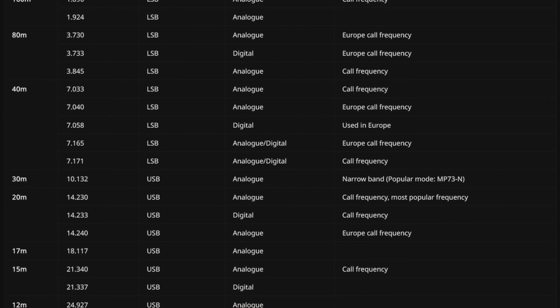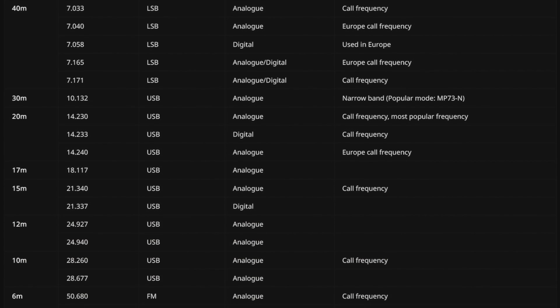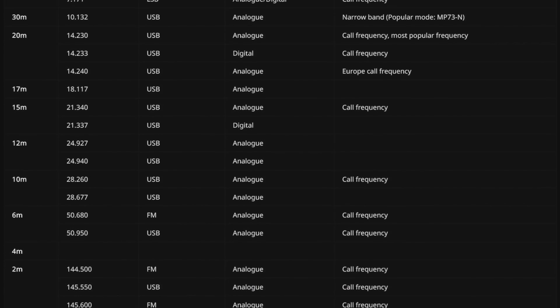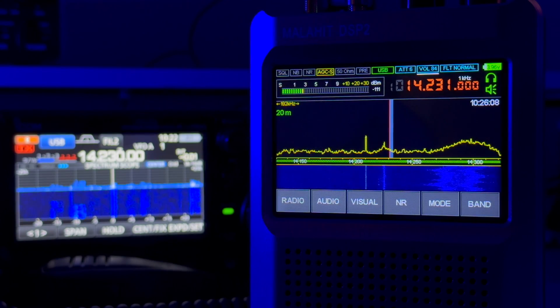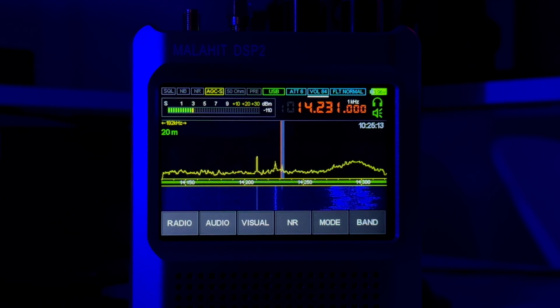So where do we find these signals? Well, there's a whole range of SSTV frequencies that are officially recognised. I spent an hour on 14.230MHz this morning and received all of these pictures — it seems like one of the most popular frequencies out there. It's not all HF either, so don't worry if you don't have a fancy radio and big antenna. There are also frequencies in use on VHF and UHF which means a VHF and UHF handheld will do the job. At the end of this video I'll include some audio clips which you can use to test with your app as practice for the real thing.